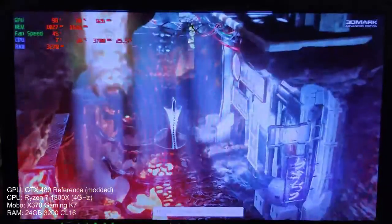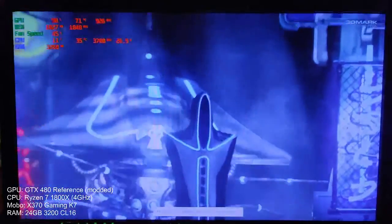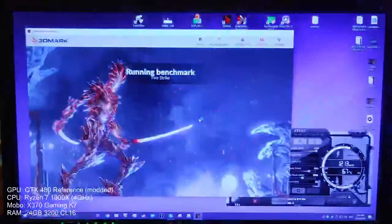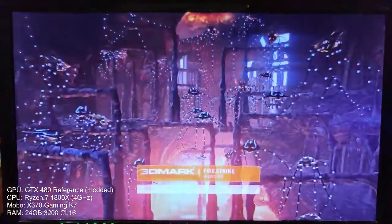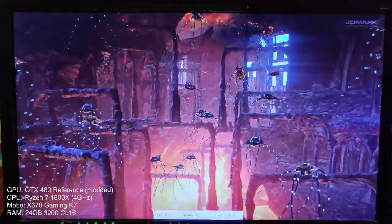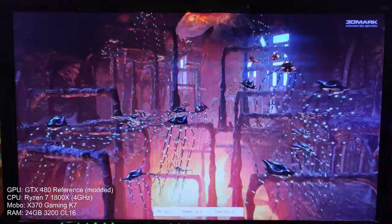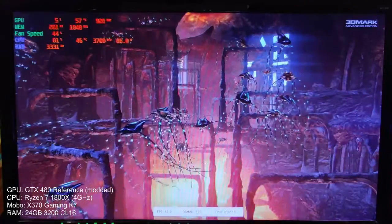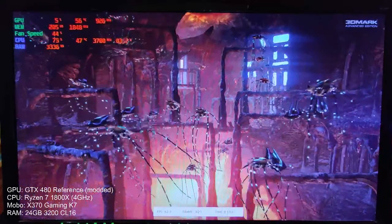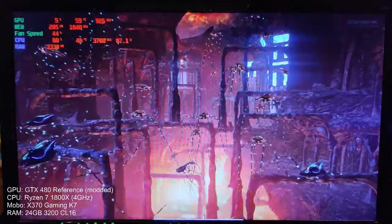We are at 70 degrees now. I mean, yeah, it's running hot. Which is kind of like, if the metal IHS wouldn't be there, we would probably be 5 to 10 degrees colder. So that's kind of killing our thermals right now. But it shouldn't affect memory so much. And the base plate is still on the card, so the memory still has some kind of heat sinking on it. So, well, 400 series for memory.